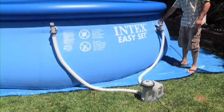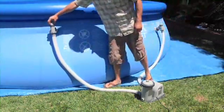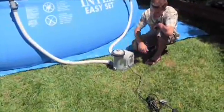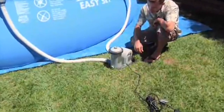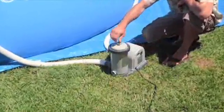To prevent airlock, open the lower plunger valve first and then the upper plunger valve. To open the valves, turn the plunger valve handles counterclockwise till they stop. Then, open the air release valve on top of the filter tower. When water flows out, gently tighten the air release valve finger tight.